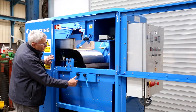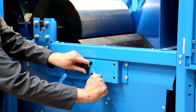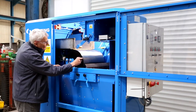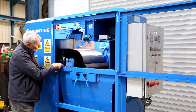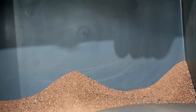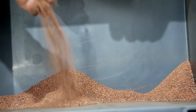The other control variable here is the splitter plate positions. As we put material onto the roll, the insulating fractions are pinned to the roll by electrostatic charge, come past the splitter plate, and are discharged by the brush at the back. Our conductors, like aluminium and copper, lose their charge immediately and are thrown off by the centrifugal force of the roll.